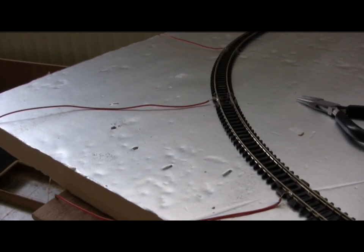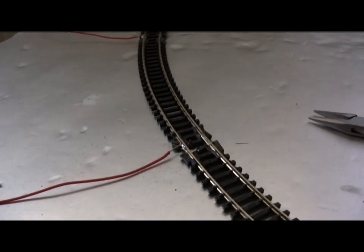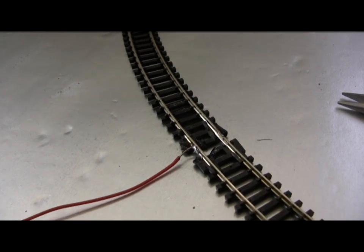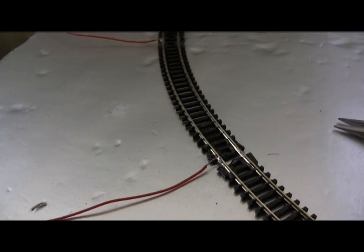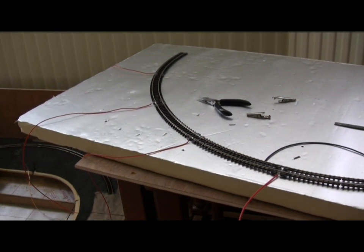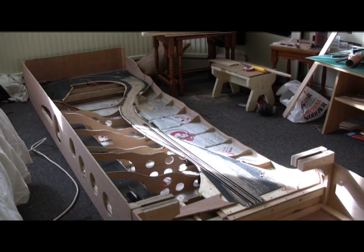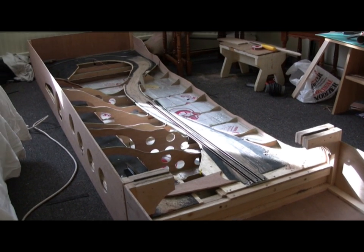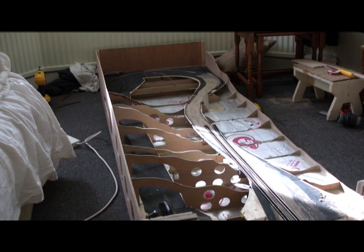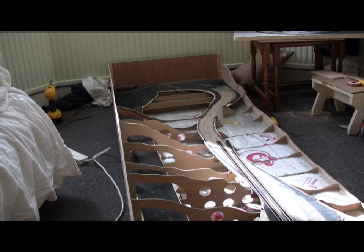And I can tell you it's not been easy soldering them, because my problem has been that when you try to solder the dropper wires you end up melting the sleepers. But I will try and show you how I've got round that. It might be a little bit primitive, but it could be useful to somebody out there. So it doesn't look much at the moment, but that's progress so far. In the next video I'll try showing you how I solder the dropper wires onto the track, because I've had major problems melting the sleepers. So I hope you've enjoyed it, I hope you've found something interesting, and thank you for watching.